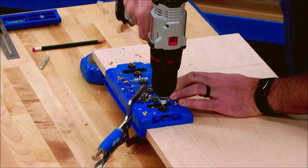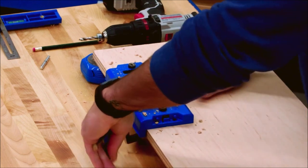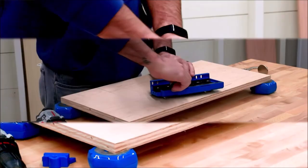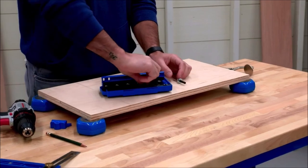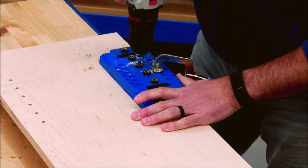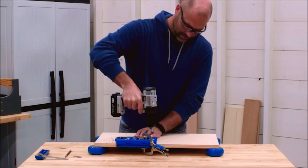The lifetime-warranted drill guides also ensure that the holes are straight, clean, and precise, so the shelf pins will sit flat. For additional assurance of great-fitting shelves, drilling is made even easier with the shelf pin jig's included bit. This high-quality Brad point bit drills a clean hole and has a depth collar to ensure that every hole you drill is the perfect depth.